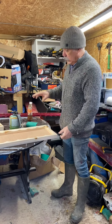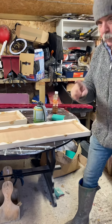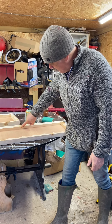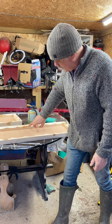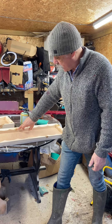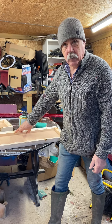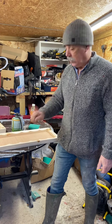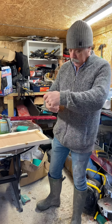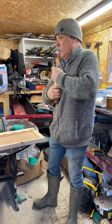It's just really useful. And the other top tip is for any of these knots - what I've done, especially in softwood, is melted it. Just heated it up and melted the surface of it. Don't be tempted to rub that down again because what you're doing is breaking the seal again. Any of the resins that are in the wood will melt and seal, act as a seal. And then belt and braces is this stuff called knotting.